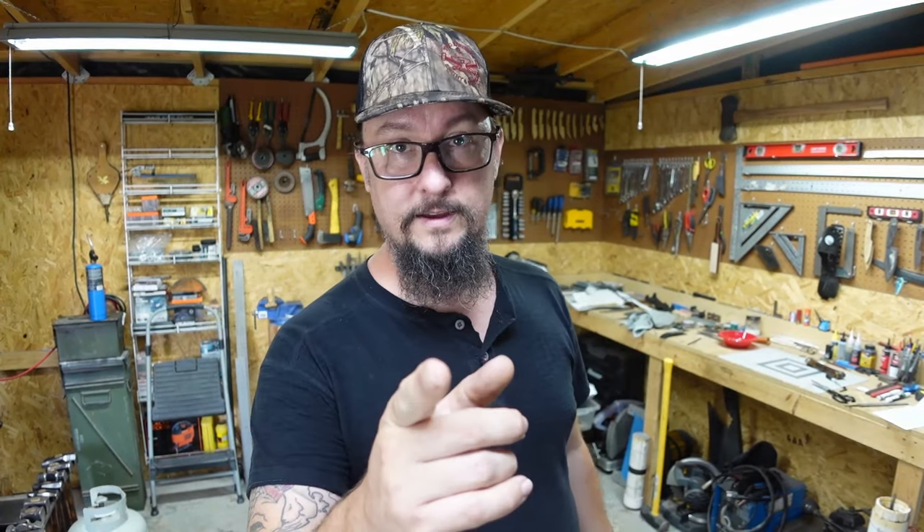I really think there should be a point in everyone's knife making career where they at least try forging. If you're going to get into it, don't spend all the money right off the bat. Get yourself a Harbor Freight or Vevor anvil, a couple of Harbor Freight hammers — you can modify them very easily to have a cross-peen, straight peen, and rounding hammer on a 1x30 or 2x72. You can make a coal forge with just bricks on the ground, a hair dryer, and some charcoal. You don't need a thousand-dollar anvil or five $250 hammers.